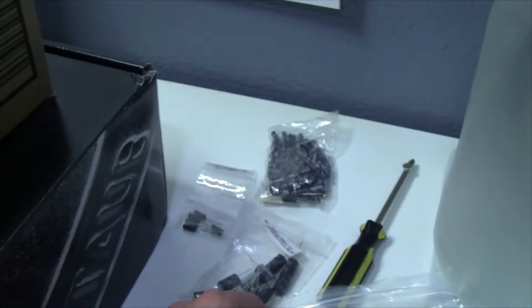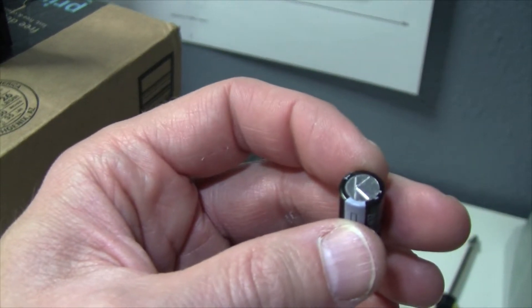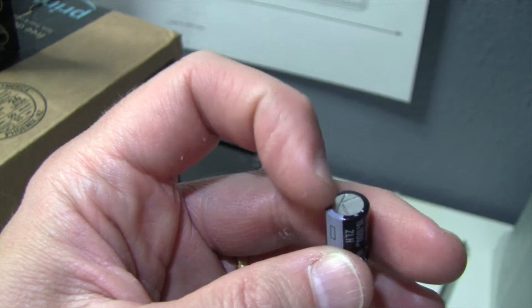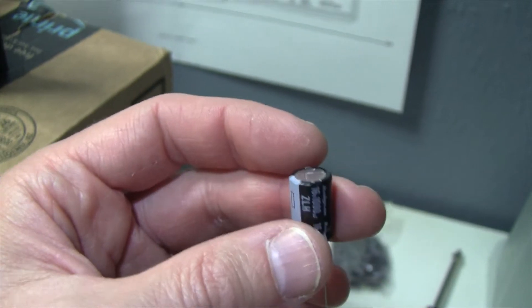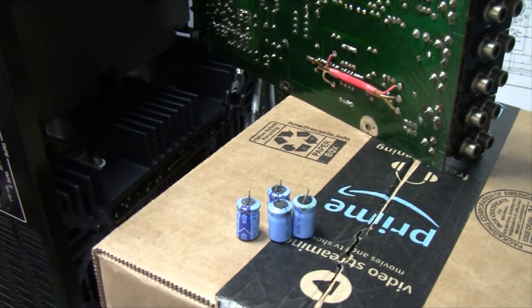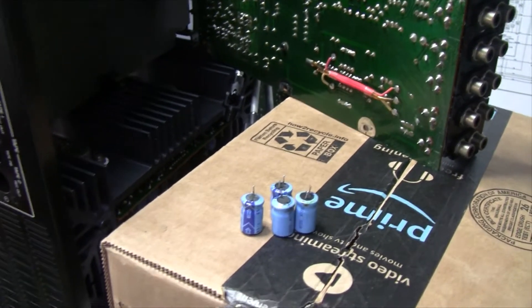That's the reason why bigger, more modern capacitors usually have what you call chamfers here — you can see the letter K on top. These chamfers are designed so that if the internal pressure increases too much, these parts open up and the capacitor releases the pressure without actually exploding like a mini pipe bomb. So, technology! I am absolutely sure now that the entire capacitor replacement is critical. Good news is that I'm taking care of this now, before it was too late.